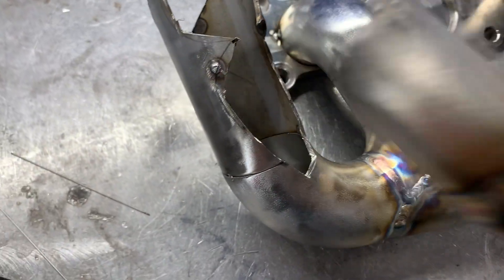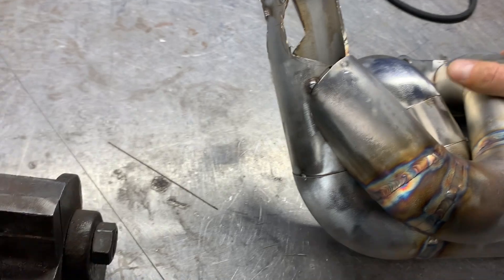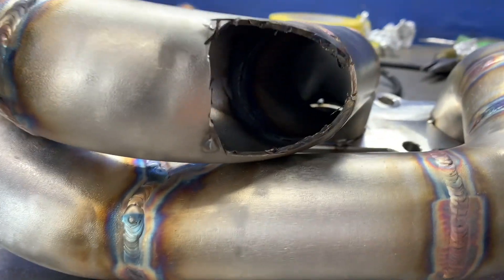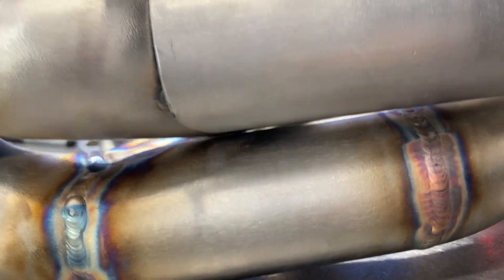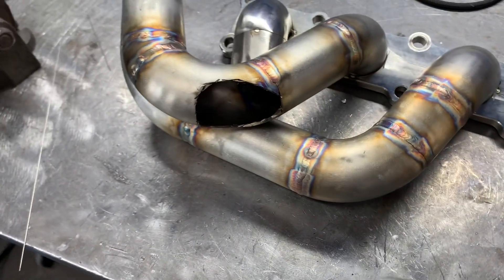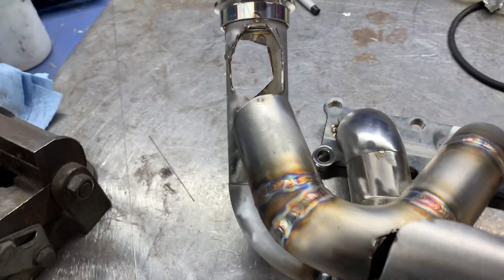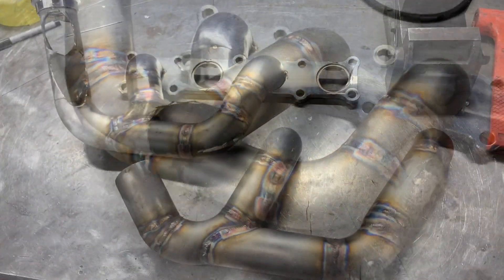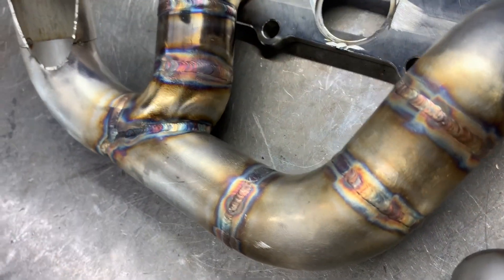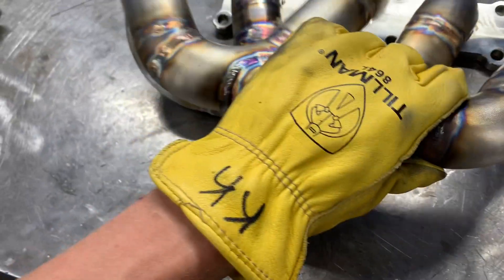So now we'll just repeat the steps for the next one. Thinking ahead — you can see it's going to be really hard to weld underneath there. So I'm going to get this runner fitting really nice, put a couple tacks on it, and then come over to this runner, get this one fitting nice, and weld these two together — at least the underside — and then jump back over and get that all welded out. Now we have our two sections fully welded, minus what's on the flange, so all the hard-to-reach spots are welded. Everything's turning out good on the back side. Now continue on to the puzzle.